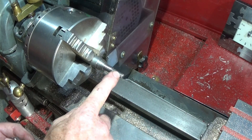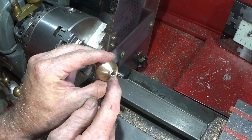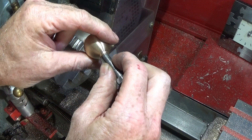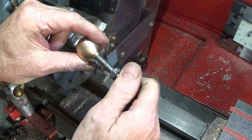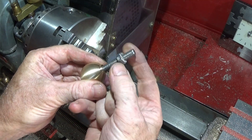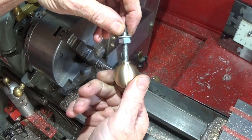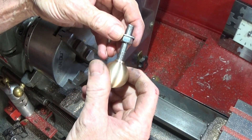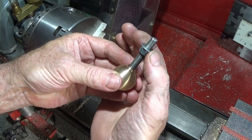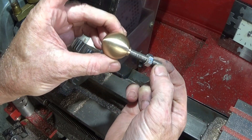That's the eight millimeter thread on my turning fixture there, and obviously it's got the eight millimeter thread in that one already. I can screw the stud into that one and put it in with a bit of Loctite 638, then put a nut on this end and a washer. That one will screw up into the underside of the block of polythene which holds the micrometer, and then lock that one up — I just locked it up on the underside of the polythene without a washer.